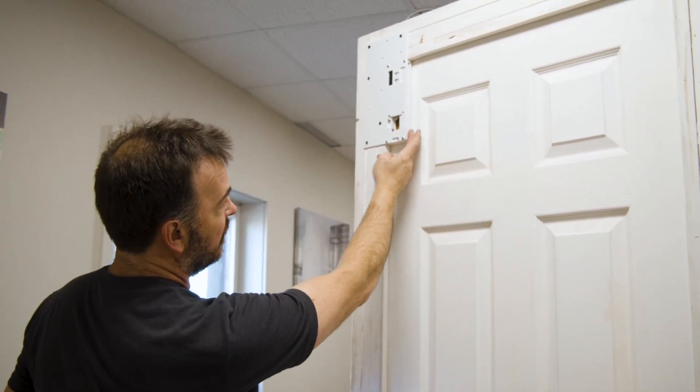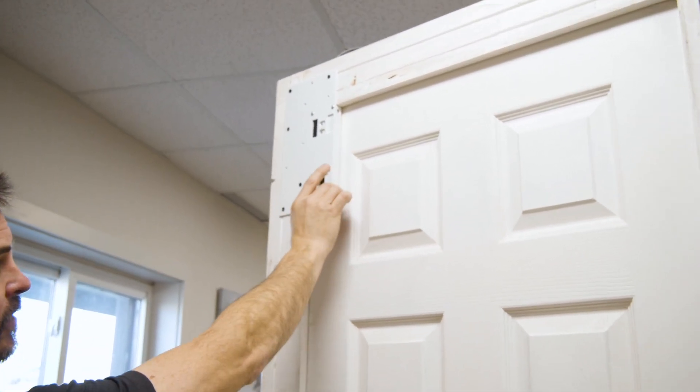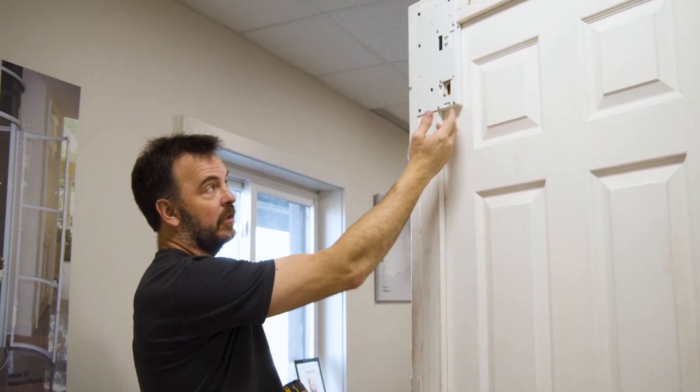The face of the door should be coming within about a sixteenth of an inch or so of the face of this interlock. If you truly have your three-quarter inch rule, you'll be very close to that. There is a little bit of play with the keeper, but not much given the small space that we're working with.